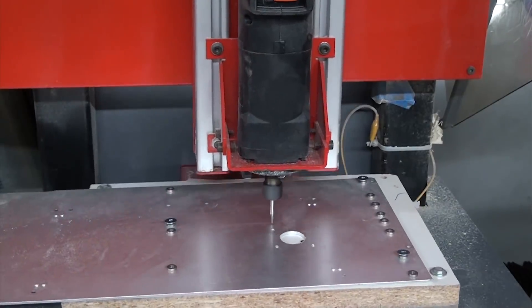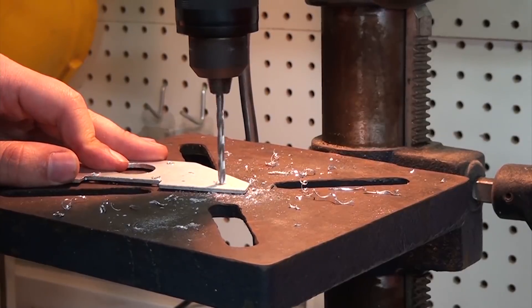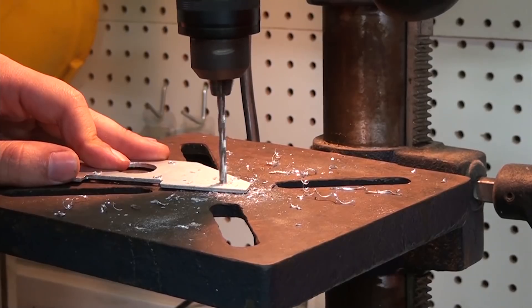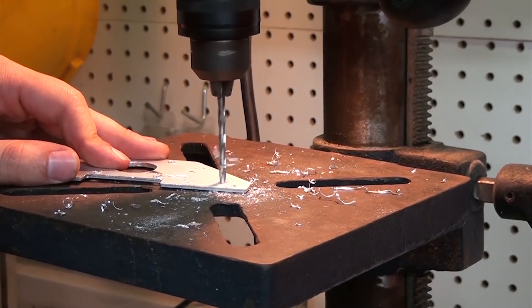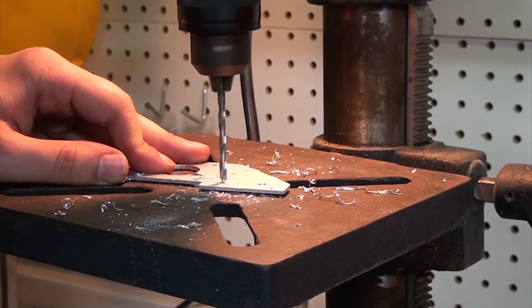With the mill free, I mounted a piece of aluminum and started cutting out mounting plates for both of the stepper motors. You can tell that this is my first real milling project, because I snapped four bits just cutting these, even with an incredibly slow feed rate. So that's going to take some more practice to get good at — and probably more bits.